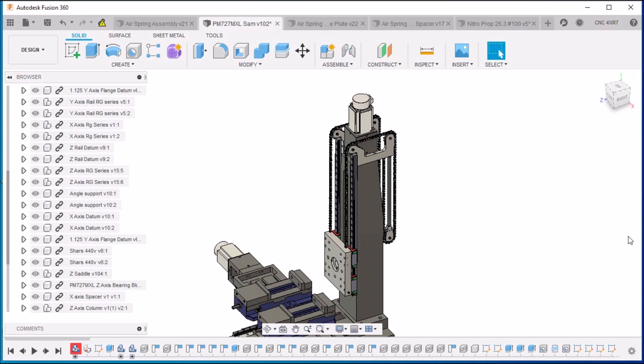It's very ingenious. I haven't seen anything quite like it, but it basically combines air springs with your traditional weight and pulley system. We're simply replacing the weight with an air spring. How this works is it's a 1-to-2 ratio. We're looking at about 140 to 150 pounds on our gearbox, so we need something around 280 to 300 on the air spring. With that amount of spring pressure, we would be able to lift the head.